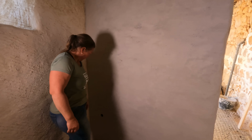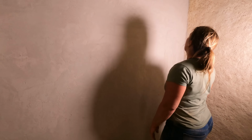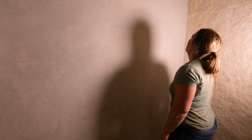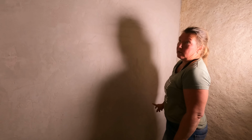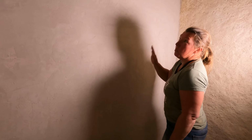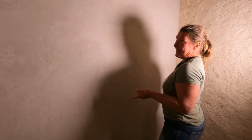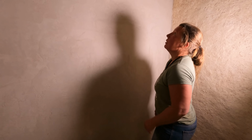That's right. Have a look at the wall behind me. I just need to adjust myself here. And so, coverage. But this is what the other wall looked like before I sponged it and troweled it. But this, I did a better job on this one because it was my second wall. My suggestion would be to do another coat to practice, to see what it looks like after two coats. Okay. Because at the moment we've got two walls that have both had a coat. Okay, so I won't sponge float and trowel it because that would be a finishing activity. So yeah, I'll just go straight over the top with another coat.